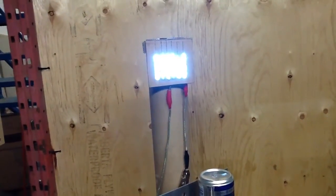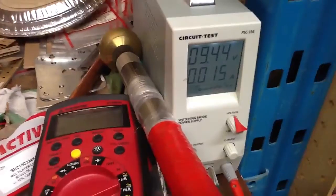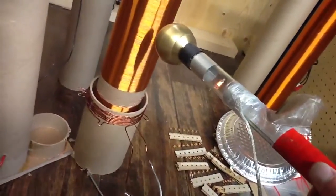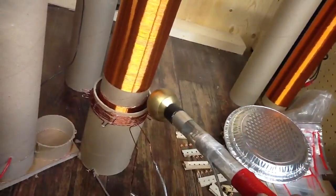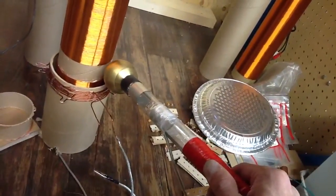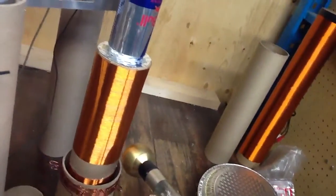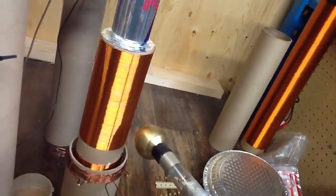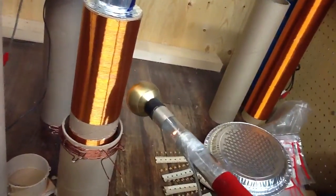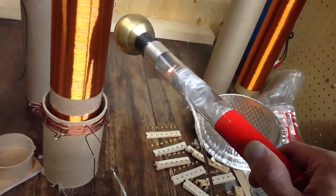This being the fundamental now, it's the strongest intensity of this one, with under 20 milliamps of current. There's a little bit more field around this one. You can see close to the secondary there's virtually nothing going on. Going up the resonator — being a series LC resonant circuit, inductor and capacitor in series — we start to get resonant rise going up the coil here.